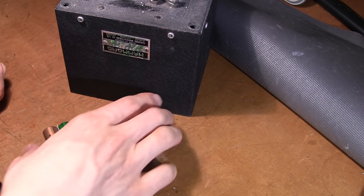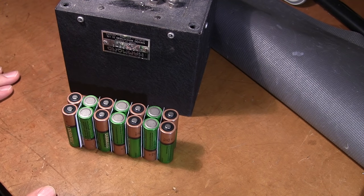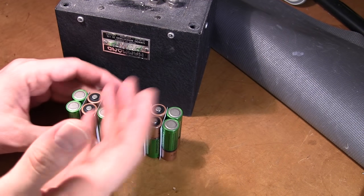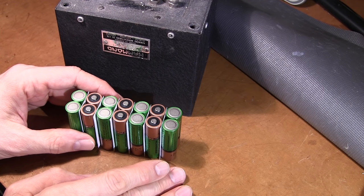I've put insulating barriers between each set of batteries. Each battery has its own insulative coating, but if they were to split down the road there would be a chance of a short circuit condition. Having these little insulative cards between each pair of batteries is just added protection. The result is a solid glued block — nice and square each way. I used this big old transformer as a square reference because it has weight to it. Once you have enough batteries assembled you can use the pack itself as a square. You've got to be very fast because the minute you touch them together they're bonded.